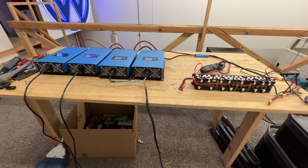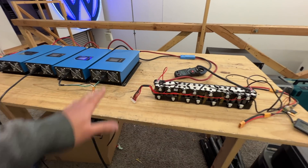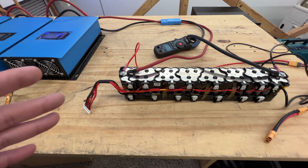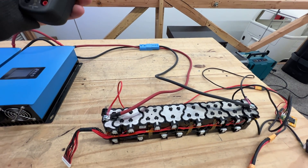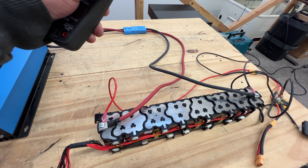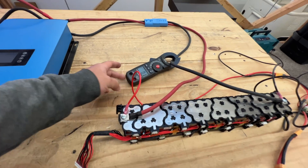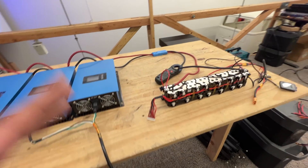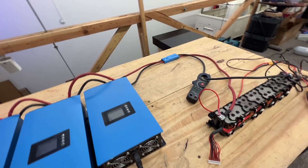We're going to start kind of slow. The problem is that this is a small battery, so I have to do it kind of quick because it'll run out of juice very quickly. It's only 301 watt-hours, right? So it doesn't hold a lot of energy, but it can give it to you all at once. So let's run it and measure the amperage. We'll set the clamp meter to 400 DC. Everything's connected. We'll just have to connect these to the grid and then this thing will start. We'll put the thermal camera in here so that we can see. Let's start this test.